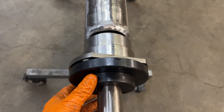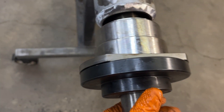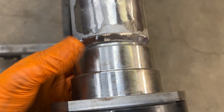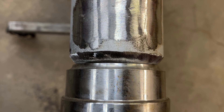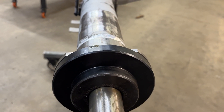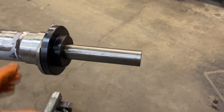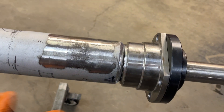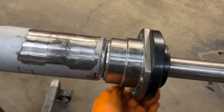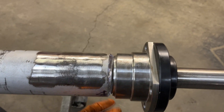The great thing about this setup is you just get everything buttoned up really nice and snug. Push that tight, and as you can see, really nice distance all the way around. You do have a little bit of play — it's kind of hard to tell on video, but there is a little bit of movement there. How I'm going to weld this — I've done it a few different ways, but I think the best way to have the least amount of distortion is to tack this in about eight places.